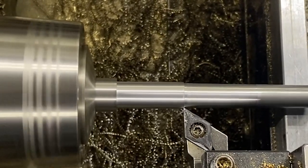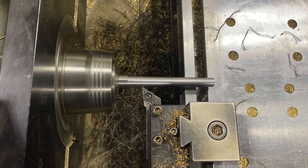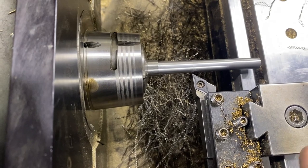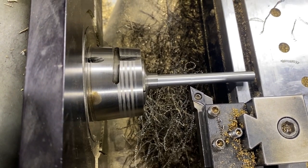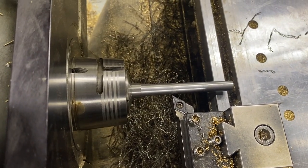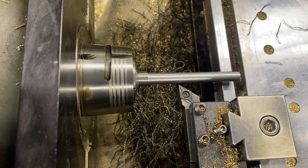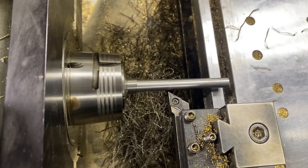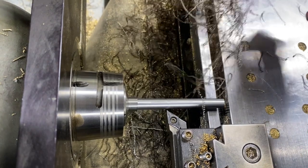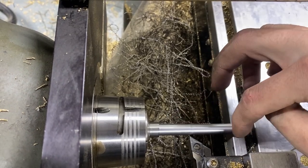Now this is the taper. You can see it's just barely touching when it comes up to the approach, which is good. G00 is the rapid command - that means the machine is going to move as fast as possible. You usually use those for linking moves, moves in between cutting moves. If you G00 to where you want the cut to be, it's very likely the machine will miss, because when you're moving a servo that fast, it's not guaranteed to be positionally accurate. If you want to go to 0.4 on X, you're going to rapid to like 0.41 and then G01 - a slow feed move - into 0.400. Visually I can see a line there, but I can't feel a line. We're talking tenths. It's pretty amazing.